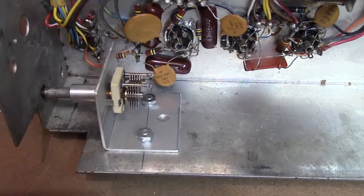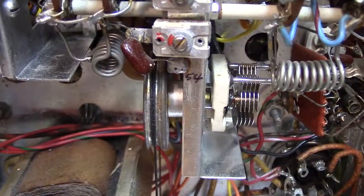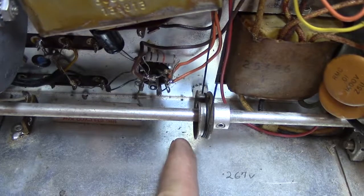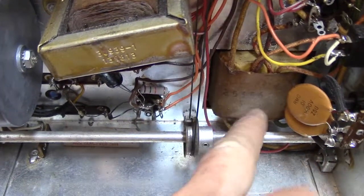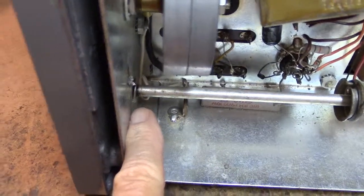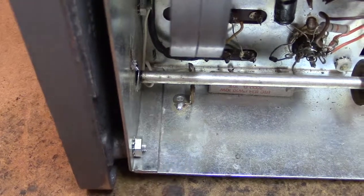You can also do this to an HQ-100, 110, and 145. On the HQ-110 you can see the trimmer capacitor string shaft — you don't have as much room to work and you've got components in the way. If you try this trick on the HQ-110 you'd probably have to move the bracket back further and use a smaller bracket. Being close to the transformer should be okay, but I haven't tried it. I have made extensions for these trimmers, but that requires bolts, nuts, brazing, a drill press, and a grinder — it's just not worth it.